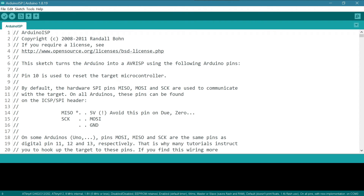Before you assemble the PCB sandwich with the Nano underneath, you want to program the Arduino ISP sketch into the Nano first. Because after assembly, the 10uF cap on the reset pin prevents resetting the Nano. So you must program the Nano first. In a normal Arduino IDE, there is no ATtiny85 core — you have to download one.